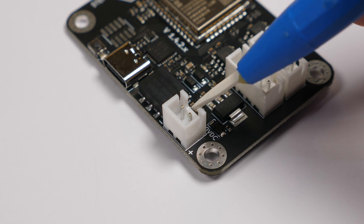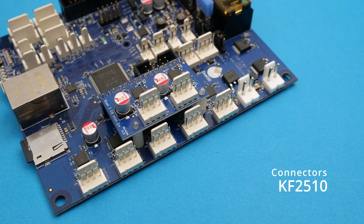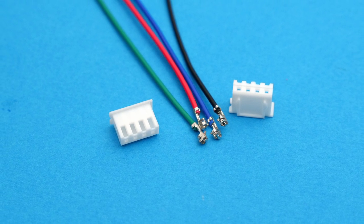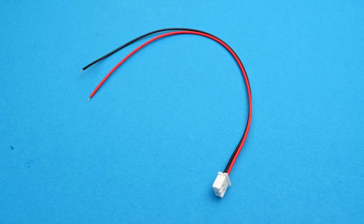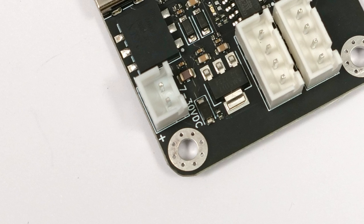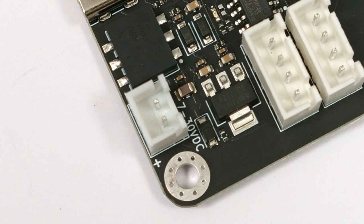However, if you have a board from Duet, for example, then you'll need to get some KF2510 connectors to make your own adapters. For the wires, I include some short extensions for the motor and power, but if self-sourcing, some 24-gauge PVC wire should work absolutely fine. The analyser can accept any voltage from 7 to 30 volts, and only draws about 0.7 to 1 watt of power.